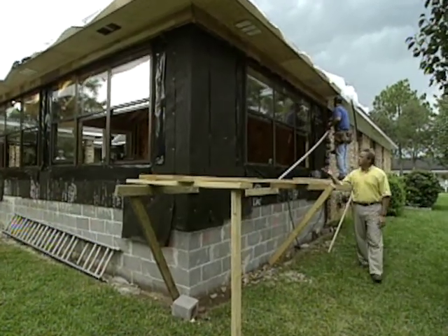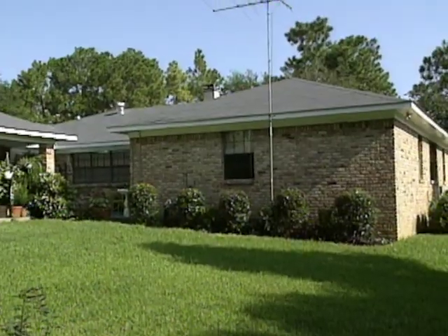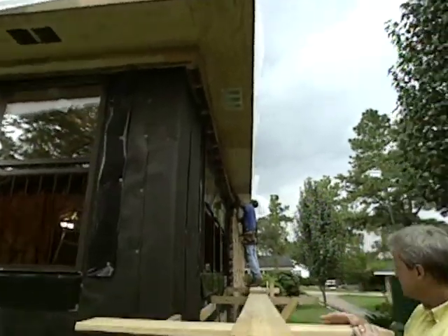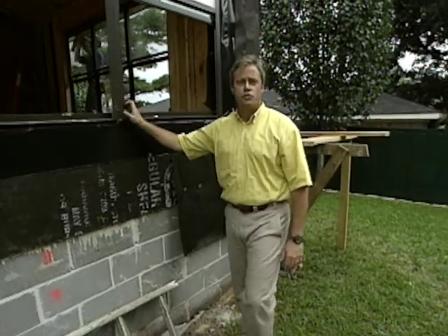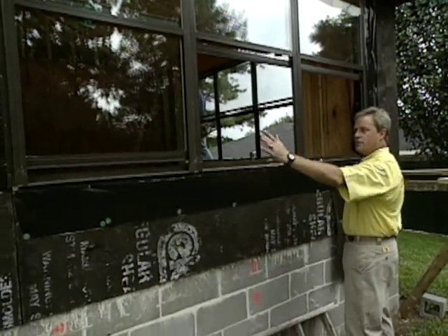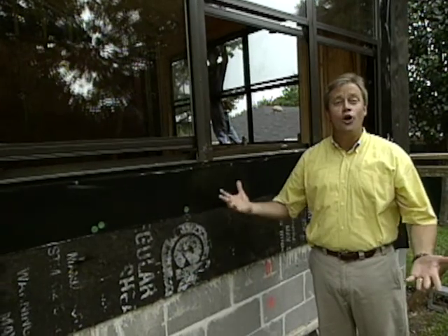When the homeowners first considered building a sunroom, they thought about aluminum and glass structures, but because this was a traditional-style home they were concerned about appearance and how it would attach to the rear of the house — the low eave area would have created a very low ceiling. So they decided to go with more conventional construction and make it a true addition. The key tip for achieving the sunroom look is to use the exact same size window throughout: here, three-foot by five-foot windows grouped as triples and singles for a symmetrical feeling all the way around.